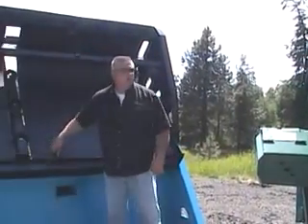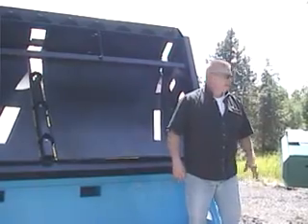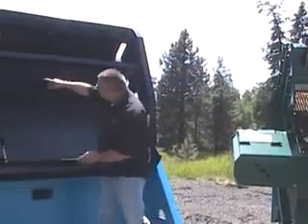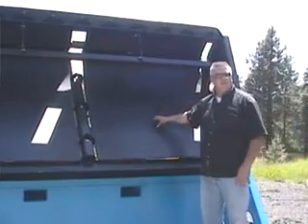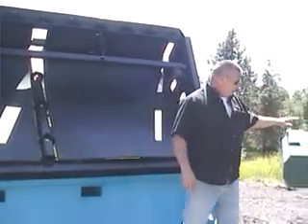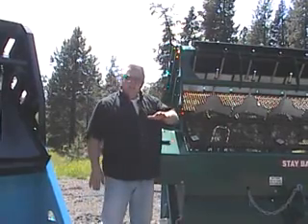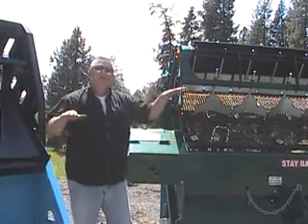This is our SLG 108 machine — again a 10-foot-wide screen deck, same as the other machine. This was a 44-inch mesh, this one here is almost six feet long from top to bottom, almost 60 square feet of screening surface. The big advantage of this is the screen deck slope. On the old design you can't change the screen deck slope — you can slide your legs out a little bit, but ultimately between wet and dry material you need more variation.